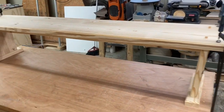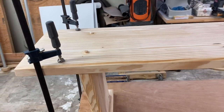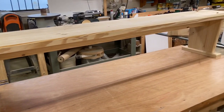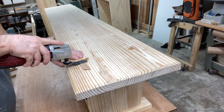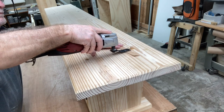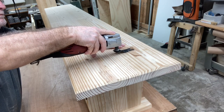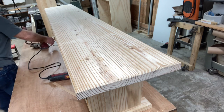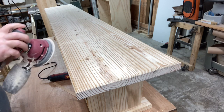Here's a quick look at the bench all finished. I'm leaving the clamps in right now to hold everything in position and allow the glue to dry. Once the glue dries I can remove the clamps and cut the ends off the dowel rods. To cut the tops off the dowel rods I'm using a hand saw. I don't have a Japanese-style saw, so I'm placing a thin piece of wood down to keep the saw blade right above the surface of the bench so I don't accidentally dig into the top. I'll sand it flush afterward. You can see smoke coming out — this is a very dull blade — so I'm only going to cut two and then go get a new blade.